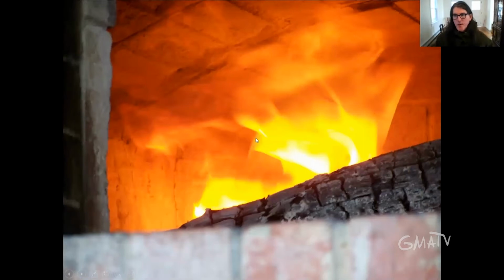So what we're doing is continuing to push energy into the battery. The longer you can keep a sustained rate of efficient combustion, the more heat you can efficiently gather and store in the masonry. And that will be really useful tomorrow. It's true that it's getting hot, right? And you can live fire cook, you have that flame in there, you're making pizzas. That is going to benefit directly from having that fire there, but we also want to put some into the thermal mass.